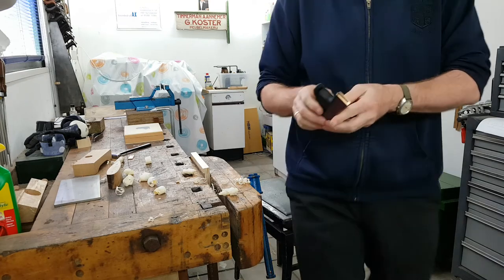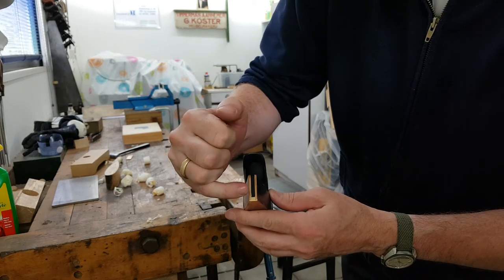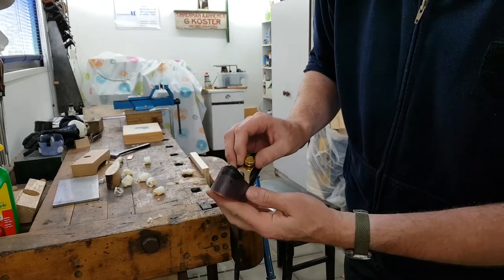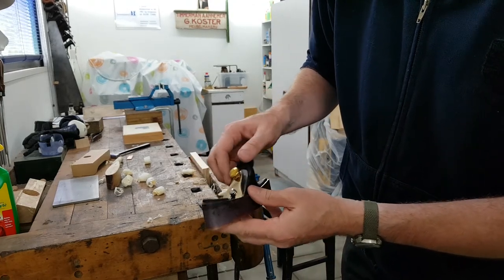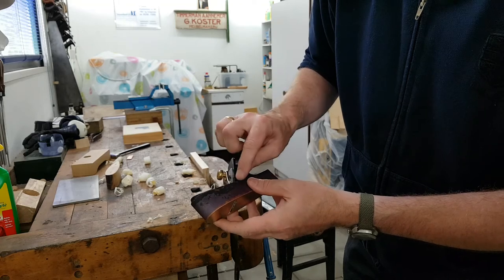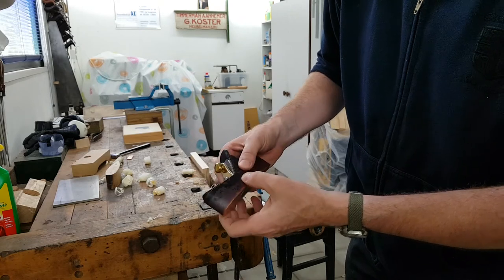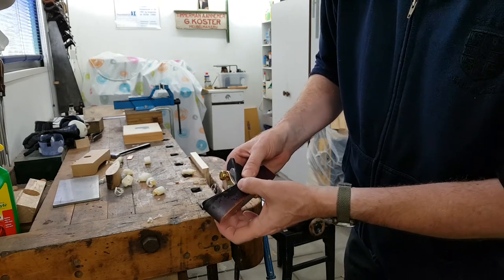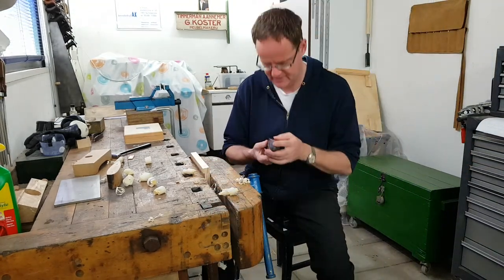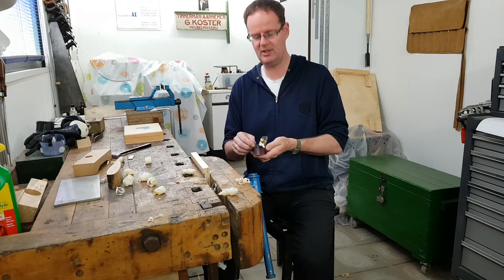There's also one thing I really like — the rear end of this. Here you can see the bronze sides, the brass sole, and the ebony infill. Really like this. I used a Stanley Bailey type of cap iron, because I didn't want to put a rivet in here as that would ruin the beautiful colours. I was also thinking the bronze was both too low in the alloy and too soft for that. The bronze sides are not as tough as a more substantial piece of steel — it's fairly thin, only two millimetres.